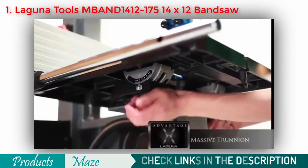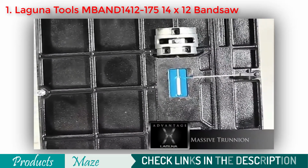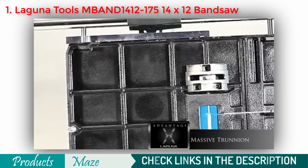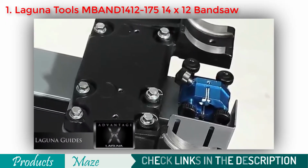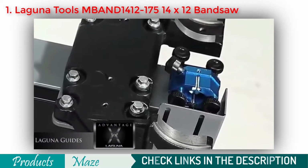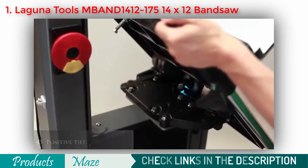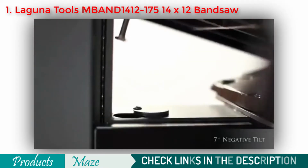The trunnion is often overlooked in bandsaw designs. However, at Laguna, we believe it is one of the key components to a solid foundation where it all starts. The Laguna guides are engineered with no moving parts and 10 ceramic inserts for optimum blade performance. The table has a positive 45-degree tilt. An ingenious pivoting cap enables a negative 7-degree tilt.